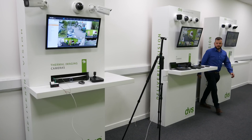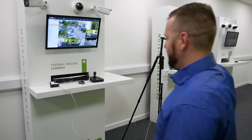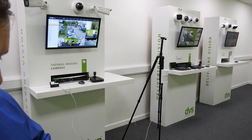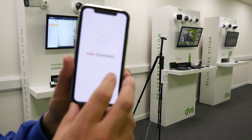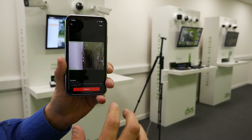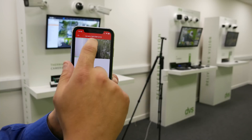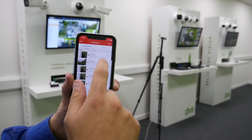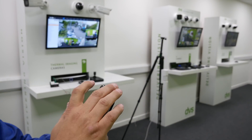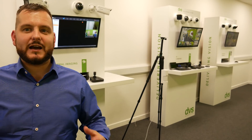From the other side I walk out — it's captured me. 180 degrees, up to 12 meters out. I'm already getting a lot of notifications. I open up the Hikvision HiConnect app on my phone, go to notifications, and you can see all of them there. Click on one, see the image, click Playback and it launches into playback. I can then do a snapshot, record it, download it to my phone, or go to Live View.